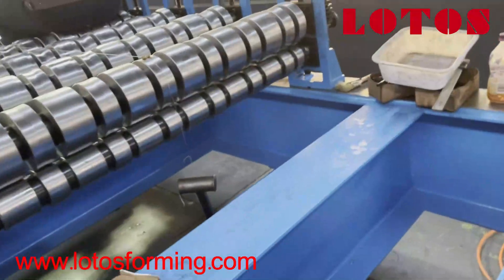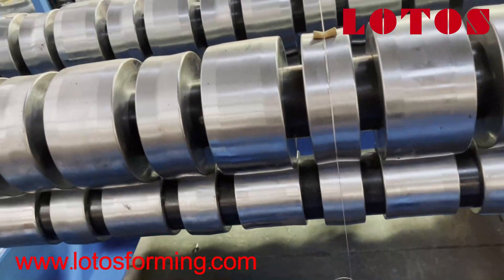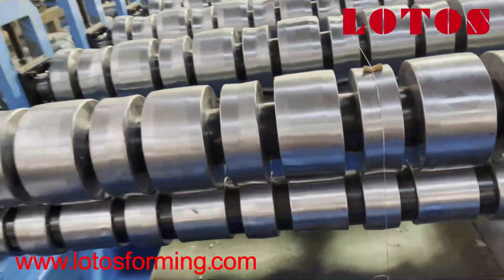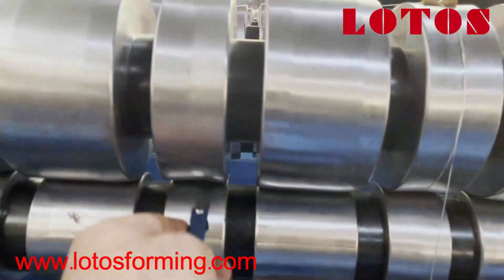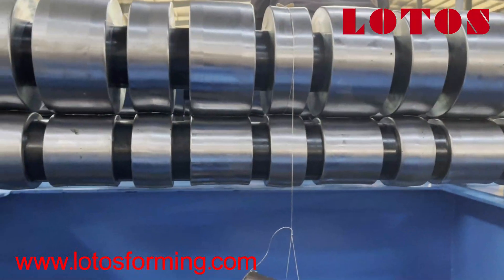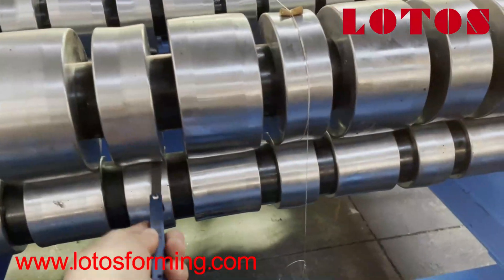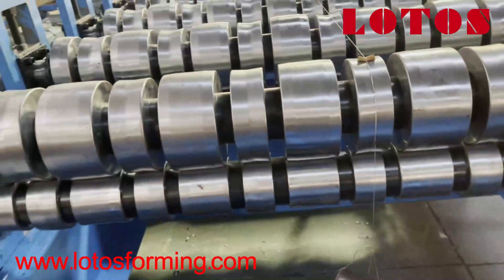Here it is also in the middle of the roller, and here you can see the gap is all the same — 0.4mm. Not very loose, not very tight.